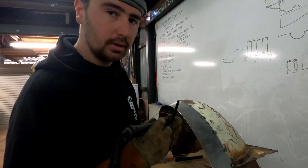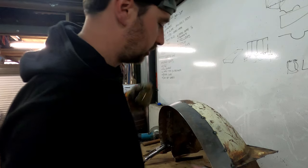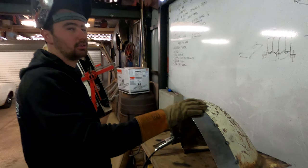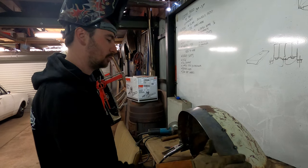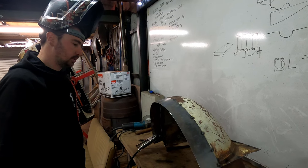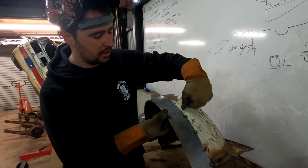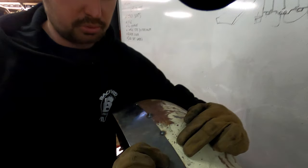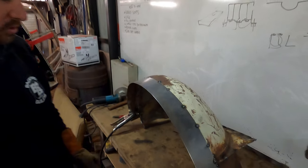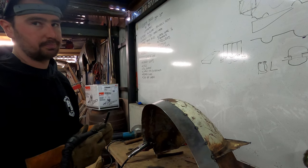One thing we didn't touch on is welding sequence. Any sequence you're going to run in particular? I might go through, get tacks in between all these, probably get up to like a 5 to 8 mil gap between my tacks, and I might quickly just buzz it off, and then I'll just go through and weld it in one long go. The more tacks you've got, the closer together it is, the less likely it is to walk around. And when I say walk around, as you weld between panels, you'll see it move like that, and it just makes it a whole lot harder to dress and weld. The better it is tacked up, the better the finished result.